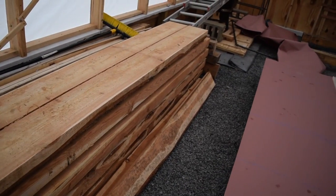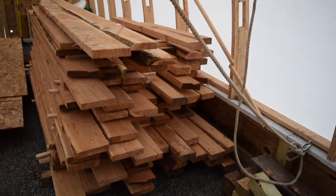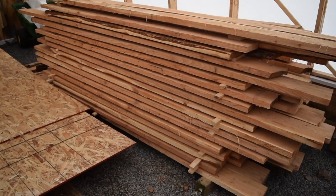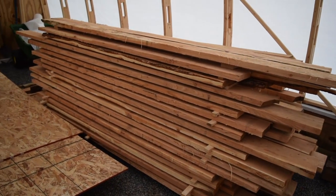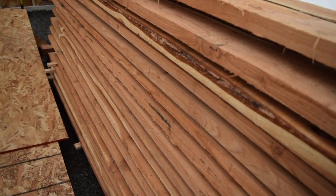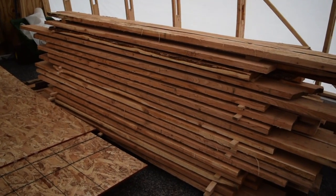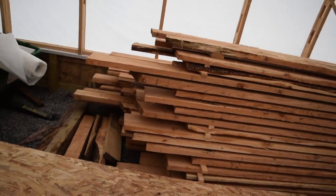The sawmill I bought it from was an Amish guy down in Jasper, New York — a nice young guy just starting out in the sawmill business. A few of the cuts have a taper where both faces aren't parallel, but they're thicker than I need so when I run them through the planer it'll get them down to size. He threw in a lot for free — like this one with the sapwood and bark edge which I can't use — but he didn't charge me for it. At 60 cents a foot I was very pleased.